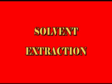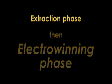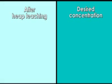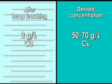A process called solvent extraction has to happen before electro-winning can take place. We're only looking at the solvent extraction part today. Heap leaching produces only low concentrations of copper in the aqueous copper solutions, and this is too weak to allow successful electro-winning of the copper metal. Also, the leach solution contains dissolved iron as well as copper, and iron shouldn't reach the electro-winning stage.